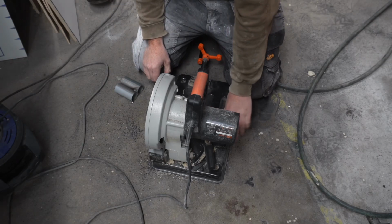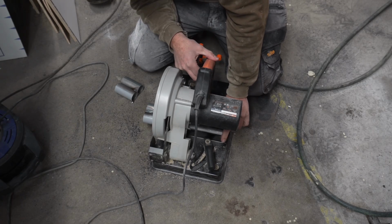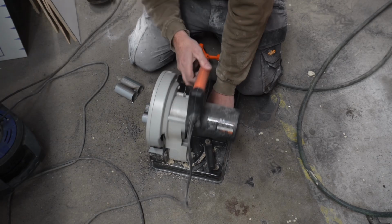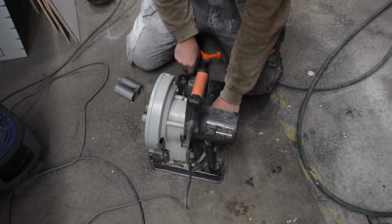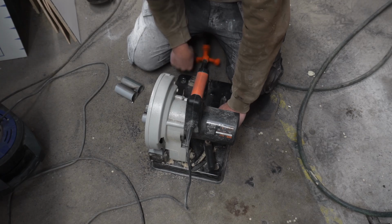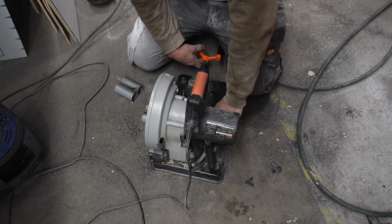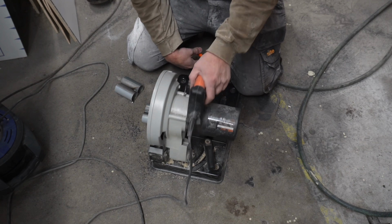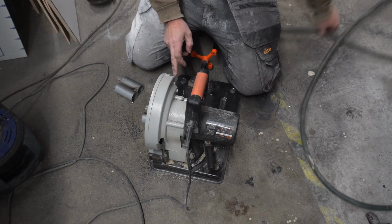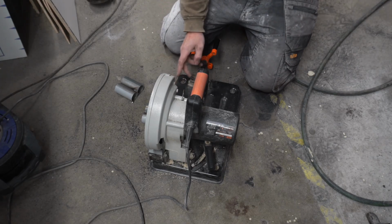Alright, I cut them so that they fit underneath the standard extended steering tube now, and then I've marked it. I measured 3.5 inches upwards, because that's what the Vespa frame is off the deck, and then I added another 1/4 inch onto it, so that should make these 1/4 inch higher up than the Vespa frame.